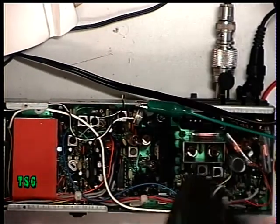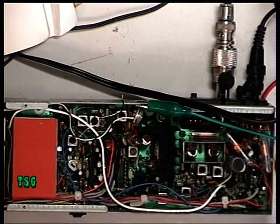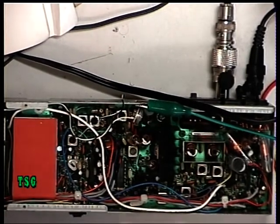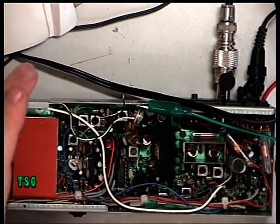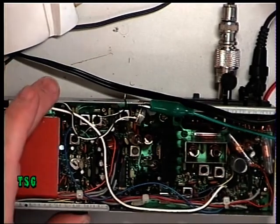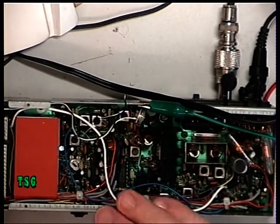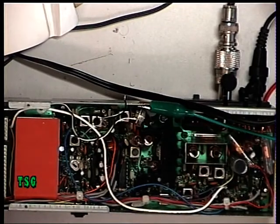That's not very sensitive — it's doing 0.7 kHz deviation. I'll do the whistle test: yes, that's doing 2.5 kHz. While it's doing 2.5 kHz we're going to leave that on full. I've been doing these radios — the TRC 1001 and 1005 — for 30 years, and maximum deviation on these is usually about acceptable without modifying the radio.